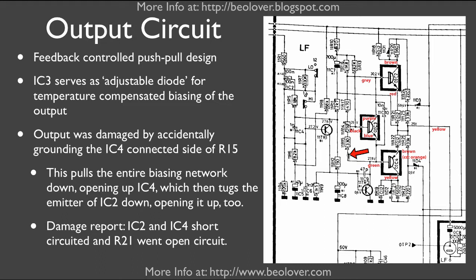I did wrap it with some adhesive tape, but unfortunately not high enough. And so, when I slipped off the trimmer, I pulled this here down to ground, because I connected diagonally with the screwdriver to the metal bracket that houses the amplifier board. As that happened, the entire network here gets pulled down.